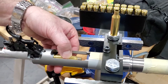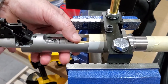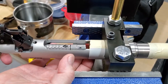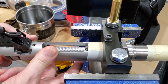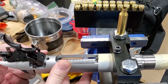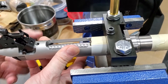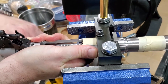I already removed the ejector pin for better fitment. We're going to try to chamber the unsized case — and as you can see, it does not chamber at all. It's actually longer than the no-go; it acts like a no-go. But remember, this case was not fired in my rifle.